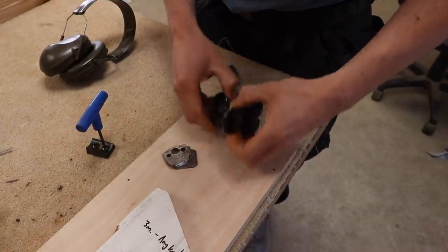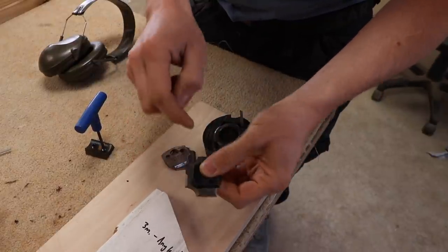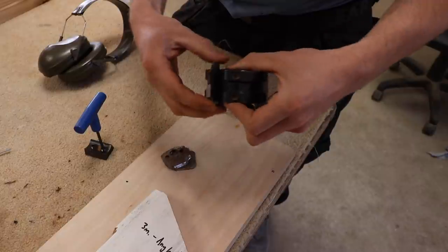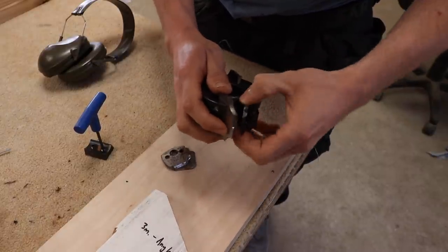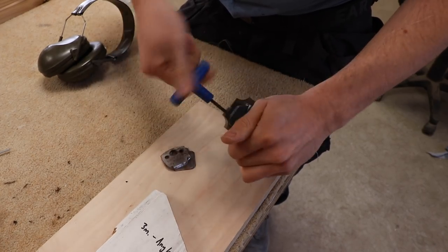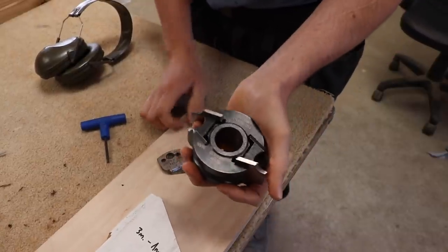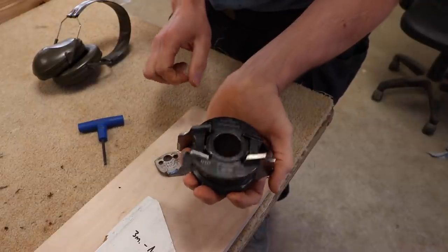It was just cutters, no limiters. So as long as when you line the holes up, it doesn't protrude past the bit that we're going to use. You just have to take it really carefully. I'm not recommending you use cutters without the proper limiters in the block, especially if you're not confident or experienced on a spindle moulder. Just nip them up tight, nothing too aggressive, especially on this little block here. This is the first block I bought, but if you tighten it up too much, it actually pinches the spindle and stops it going on the spindle.